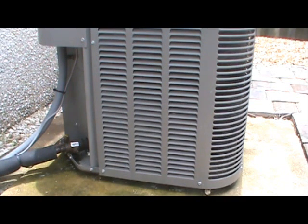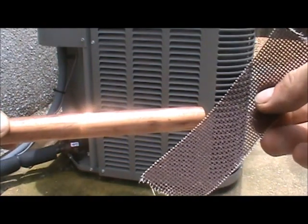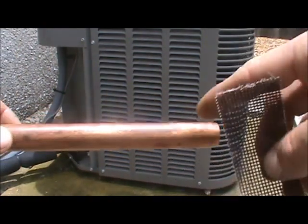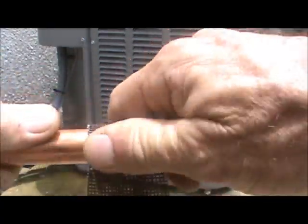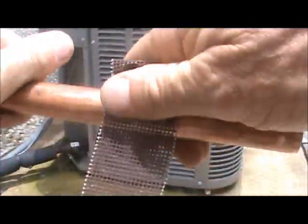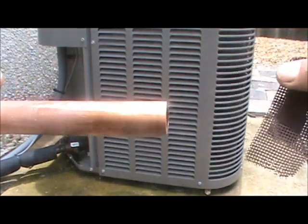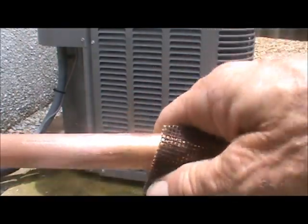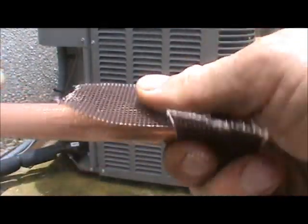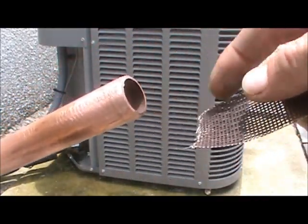One of the first tips — you don't have to do this, but this is what I do to make it a little bit easier. If you have your piece of pipe that you're getting ready to braze in, I will usually clean it off with the sand cloth or the mesh type cloth. You can see there's some corrosion and discoloration going on here. So I'll mark where I want to cut the pipe and clean it at the point where I'm going to make the cut. It's much easier to clean it a few inches down below the end of the pipe than trying to clean it after you cut it. I'll clean it before I cut it, and that way you don't risk getting any of the sand or residue down inside of the pipe.